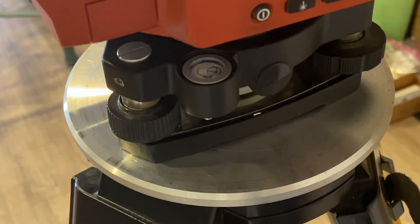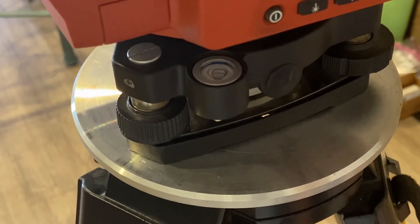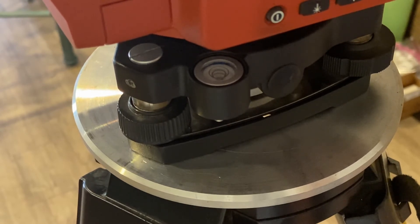This is a close-up review of leveling the tripod with the head unit placed on top. We've noticed that the bubble level is facing down and to the right. So we're going to take this leg on this side right here and go ahead and unloosen it as shown before. We're just going to let it down gently until that bubble level is right in the center — just like that. We're going to lock that down and now we are ready for the next step.